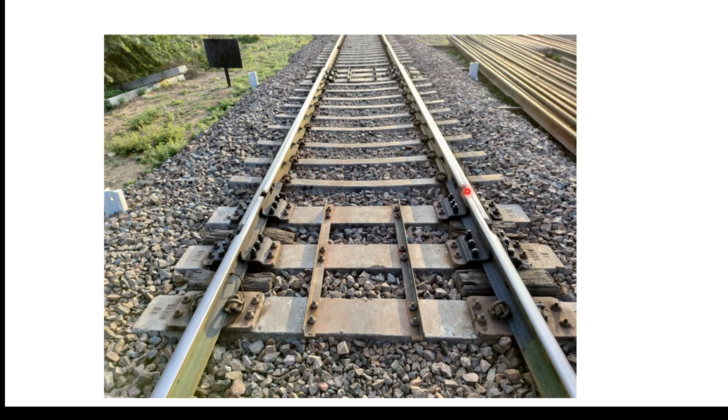In the double gap SEJ, two gaps are provided — one gap on each side — and each gap caters to the LWR on its respective side. The tongue rail is manufactured by cutting the rail vertically through the head and foot location. The two cut rails are then joined together to make one stock rail, joined using bolts at the web. This stock rail is considered to be static, with negligible expansion and contraction in length due to temperature. The LWR on each side expands and contracts at the gap while the stock rail remains static.